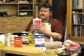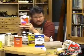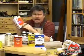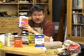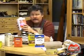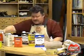Incidentally, just two brief asides of linseed oil because it's useful in wiping on. First of all, get the boiled linseed oil and not the regular linseed oil. Boiled linseed oil is a finish. Ordinary linseed oil is a liniment. It will never dry. Boiled linseed oil has been messed with. It's been heated up. Not boiled, but it's been put in a retort and what is called cracked, and then they add some metal salts to it to help dry it. This stuff you can use for finishing, but you can't drink it, and it wouldn't be a good idea to use it as a liniment either.